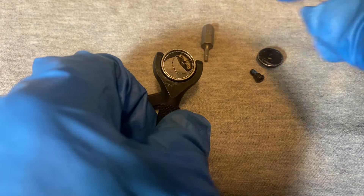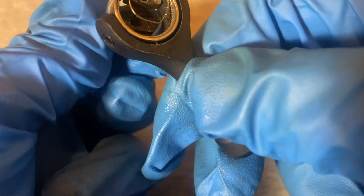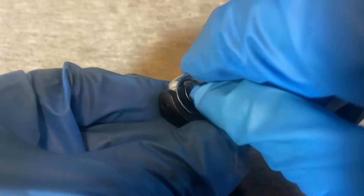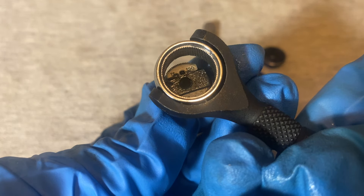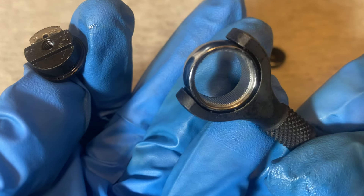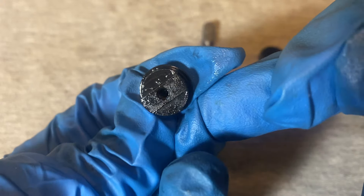The protrusion on the switch goes into the heart spring. Here is the heart spring that helps facilitate the switching of the pawl. There's a tiny pawl, and it looks like there's a super lube style of lubricant on it. You can see the tiny tiny teeth on this 90-tooth ratchet. Here is the pawl, and everything has a good slathering of super lube or something similar.